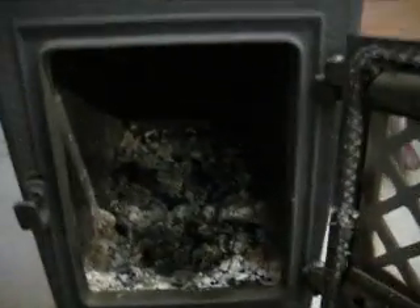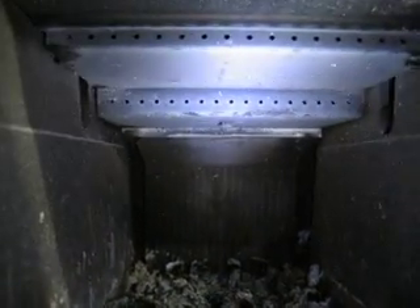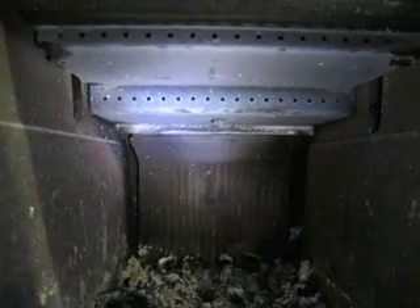So I'll go ahead and show you that on the stove now. Here's the stove opening. You can see there's that air chamber that brings in secondary air, comes out those holes, and burns the unburned gas. From there, you can see that it then travels up into this spot where I have the hot plate taken off. So it comes up through here, and then it travels underneath and then back out.